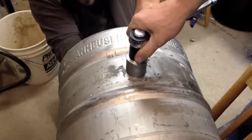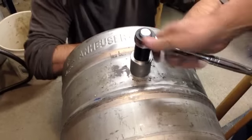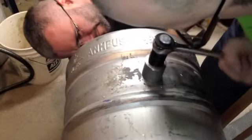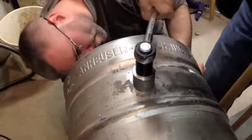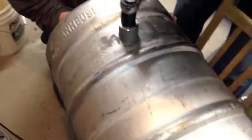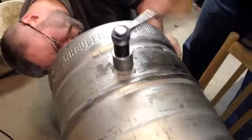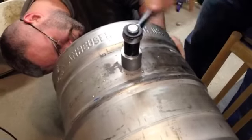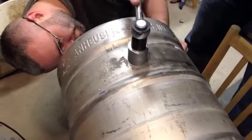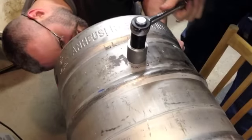Once you've done that, you're going to follow the same procedure — crank down those vice grips or box wrench or whatever, and then crank away. Again, it starts the same way: a little hard at first, but then once the coupling lip passes, it loosens up a little bit. Keep an eyeball on the inside so you know about where you want your depth.